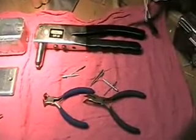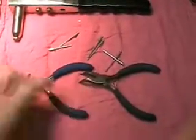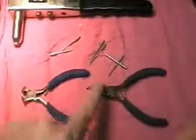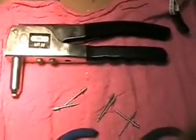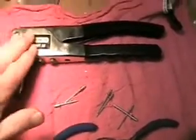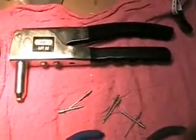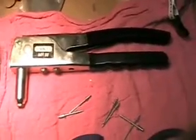Let's take a look at some of the things we'll be using and some tools you'll need today. You'll need some pliers, and we're going to take a look at some of these little nibblers — you'll need those perhaps. I've got some needle nose pliers that are bent; just any needle nose pliers will work. We're going to build the antenna switch today and put it together with pop rivets. You can also use number six machine screws — it'll work just as well. I just prefer the pop rivets; they're a lot quicker, and on these projects where there's not a lot involved, I can either grind the pop rivet out if I need to.